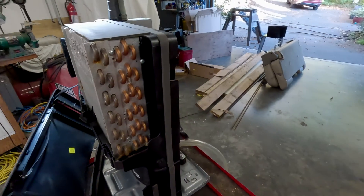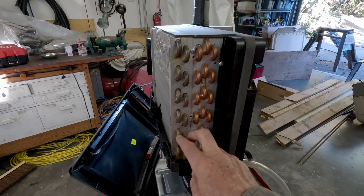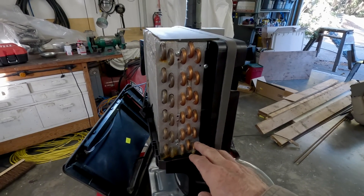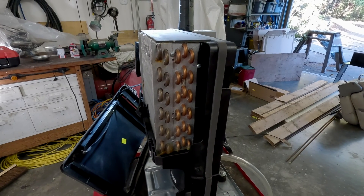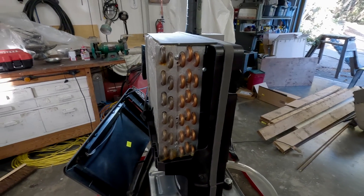You can see there are two sets of coils. These are the evaporator coils and these are the condenser coils. In contrast with a normal fridge, these are back-to-back because this device is optimized for collection of fluid, not for generation of heat or cooling.